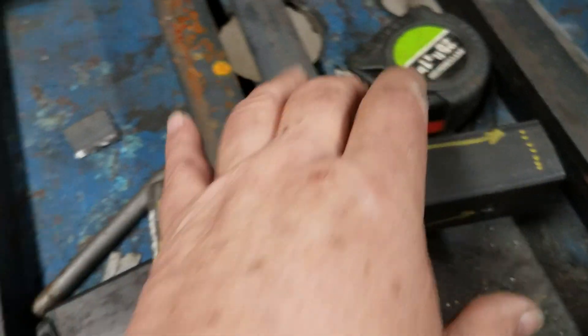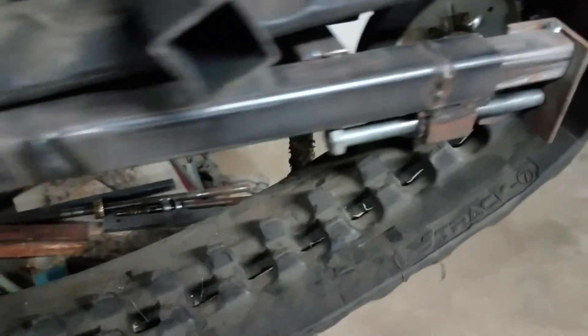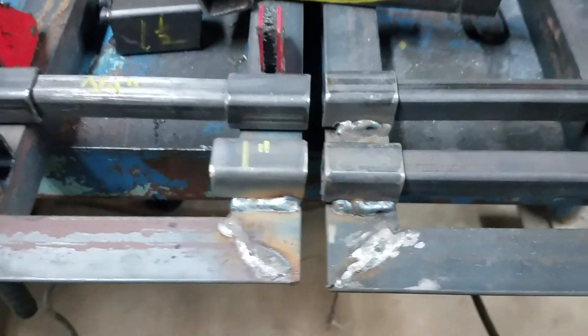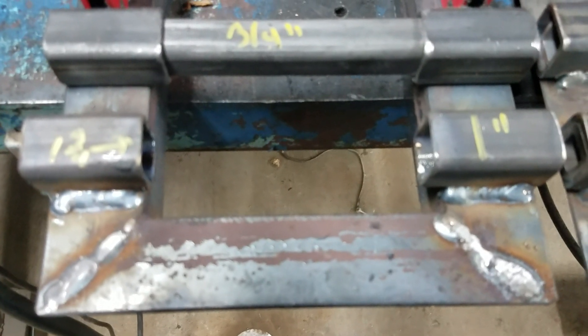This allowed me to get my bogeys on, and with all four sets in here I still have enough room for some adjustment. If you made shorter arms, your track has to be tensioned out farther and you'd run out of space. As I mentioned last time, either lengthen the frame or make larger arms. I've taken this back apart since I only had one done, and I thought it was a good place to stop and show you how I did this.